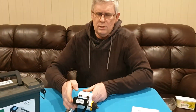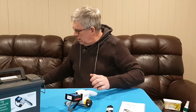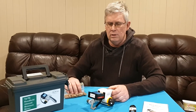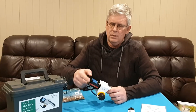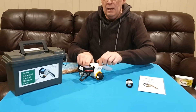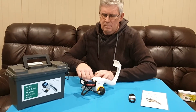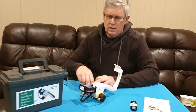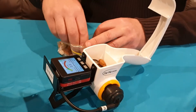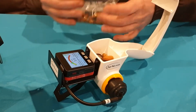To take a moisture sample, I have some kernels cracked from almonds at different moisture contents. We've set the meter to kernel mode and put the plug in. Next, we put in 10 kernels — 10 is a good number, as once they're grated they just over half-fill the chamber. So there's 2, 4, 6, 8, 10 kernels.